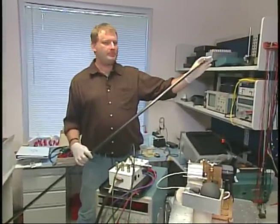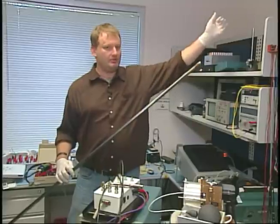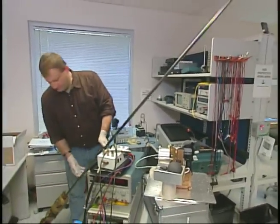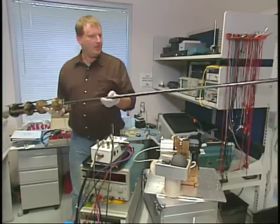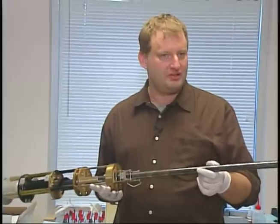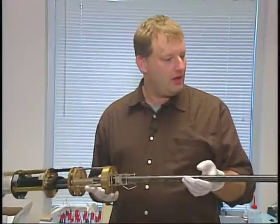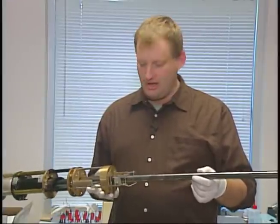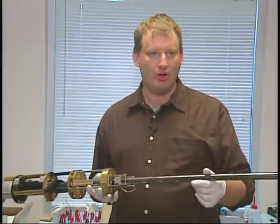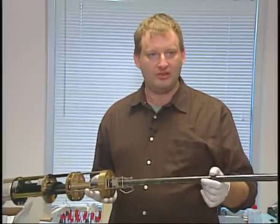There's another one of these electronics packages here, and then there's a much smaller one of these spring-loaded antennas that gets loaded onto the top of this. Technically this is called a Stacer, and this sort of deployable antenna is a specialty of space sciences. We have a lot of experience in this, both on spacecraft and rockets. It's a complicated mechanism, but it's basically the best way to get out a stiff thing a long way from the spacecraft and get your measurement as far away from the noise as possible.